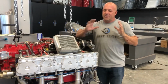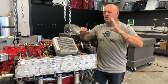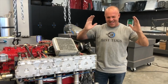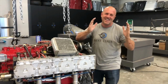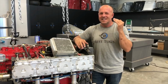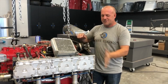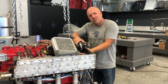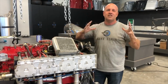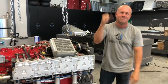cylinders. So this engine used to have an intake about that big. Even taking the two oil coolers out, I'm going to have to go about that big. If I didn't take the oil coolers out, that'd be stupid, or I'd have cylinders sitting in the 400-plus degree range, which is not going to happen. So that's what I've got to do. Oil coolers gotta move. I gotta cap the back of this, make a new carbon fiber piece, tighten up the plenum, and enlarge the opening. So I've got a lot of work to do. I'm going to get back at it. As always, back to work.